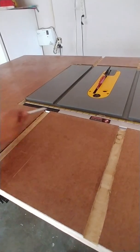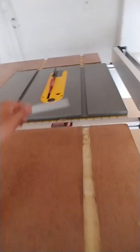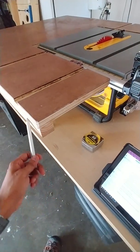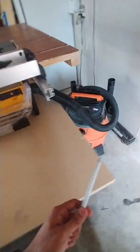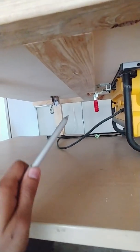The cutout is about 22.5 inches from this edge to this edge, and about 22 inches wide, so the saw can fit inside. I tried to make the infeed a little wider than the outfeed — the infeed is about 11.5 inches and the outfeed is about 8.5 inches. Under this there is a 2x2 running all the way width-wise at the infeed edge, one on the other side as well, and also a 2x4 running lengthwise for support.